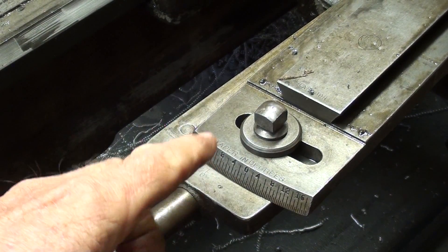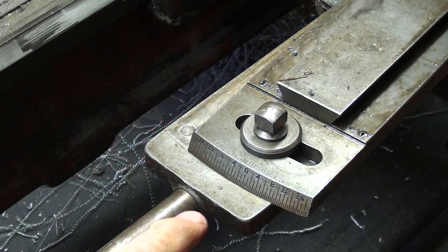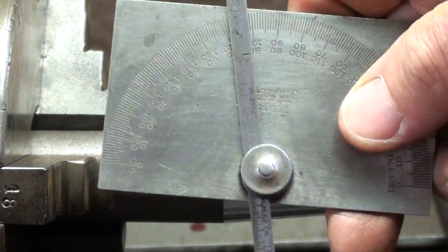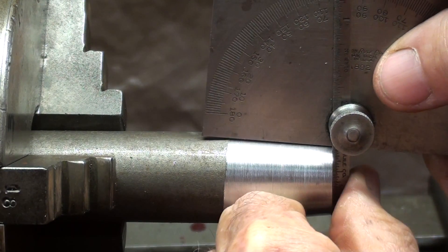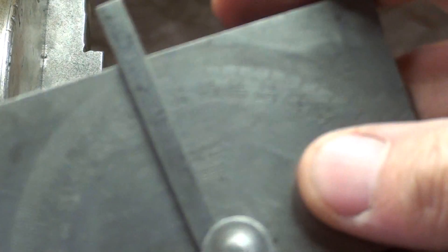Getting back to making this setting: you might find that some machines require you to set it for half of the angle. In other words, a ten-degree taper might be set at five degrees on the bar — on some machines. But mine is ten degrees at an included angle, and I set it for ten degrees on the bar. Using a protractor pushed against the squared-faced end, this should read five degrees — not ten — because that's just one half, one side of the included angle.